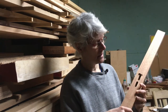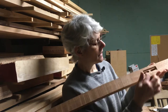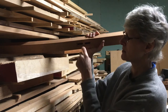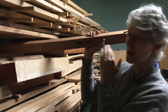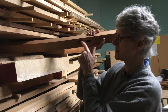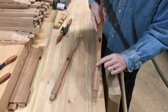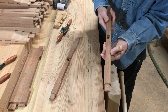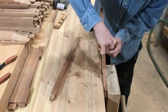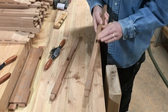The difference is that these legs need to be tilted on the table in order to achieve that angled profile. The table will be tilting forward in this direction — I need this side cut deeper. So I have to make sure that I have these laid out on the table in the correct direction and tipping up the correct direction to match what I've done with the chair rails. To shape the round over on the inside bottom edge of the stretchers, I'm going to be using a spokeshave, and the rest of it will be sanded away by hand.